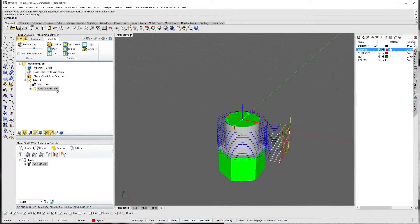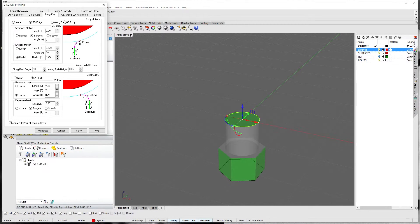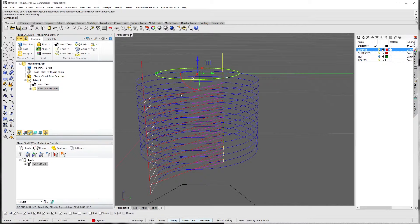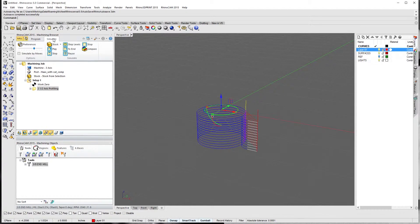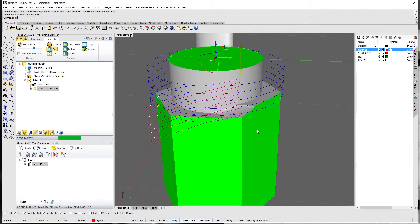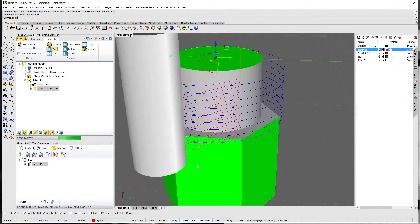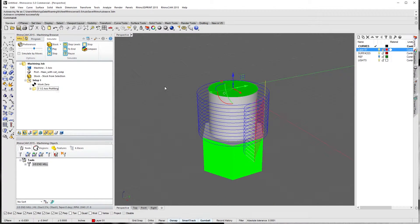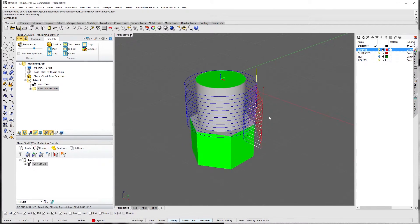The other option is if we go into entry/exit and go to along-path 3D and hit generate, you can see it's following into the path instead — so it's going to cut first with the bottom of the tool rather than the outside. Depending on how worn your tool is, you can see how it tapers right down. The simulation is quite cool for showing you what to do. That's just as good, so we'll leave it at that. We've got that set up the way we want it to look.